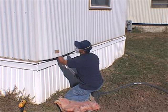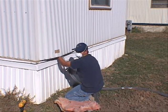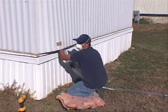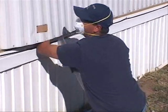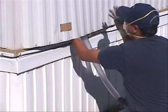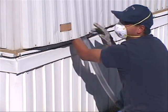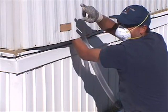While I'm pushing this tube up the wall, there are two belt rails on the mobile home. What we need to do is make sure that we get the tube underneath, behind the belt rail, past the belt rail. We want to get all the way to the top of the cavity, and also we want to be aware of any electrical outlets that might be on the wall, as well as electrical wires that might be running horizontally.